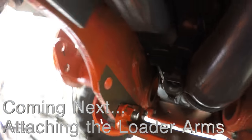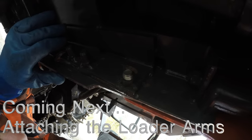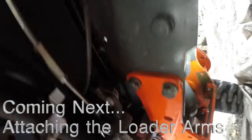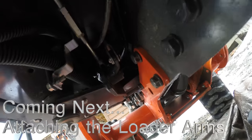The nuts are welded in on the back — that's why I said you can't torque the nuts, they're welded to the frame. So although you're supposed to torque nuts, in this case you only torque the bolts. Hopefully that was clear.